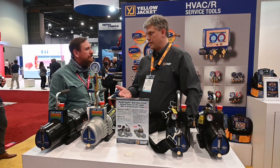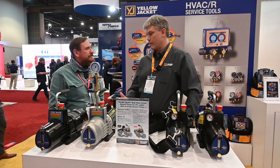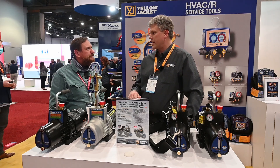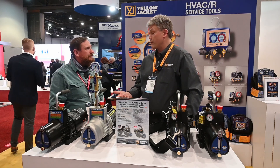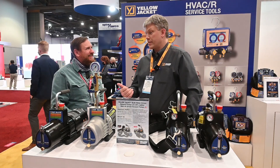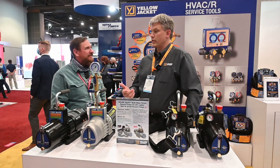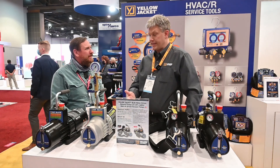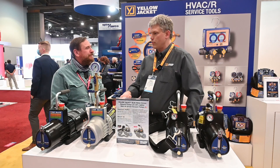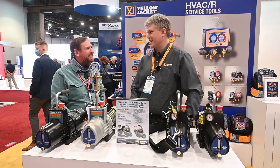So if you're not at the job site the whole time — because sometimes these are big systems — you're able to get all that information, have it all recorded, pull it up and say, okay, what did this actually do overnight? How fast did it draw down? And then at the end of the day, where am I at with the vacuum? Even more important than that is proving that you did the vacuum. And the cool thing with our app is you can actually do a vacuum hold test — a decay test. So now I can say, okay, I pulled it down, and not only did I pull it down, I shut the system down, it wasn't running the vacuum pump anymore, and it held the vacuum. So your system is actually complete — it's not going to leak on you.